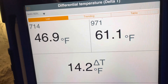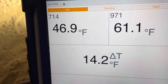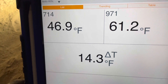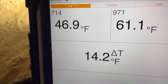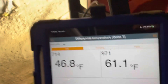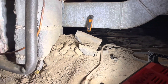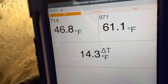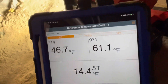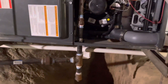We got a really chilly house — like 61 degrees. Temp split is at 14 degrees or so. I'm not in the best measurement spot, so I might add a degree or two since I'm after this transition. I might call that more like a 15 or 16 degree split, but yeah, we've got a really chilly house here.